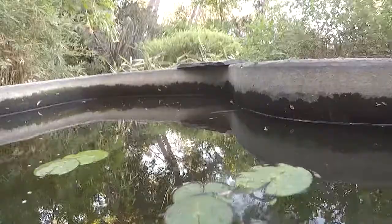We're also going to be installing a new proper bottom suction and a skimmer inside the pond here. As you can see, the water is very murky, very dirty. They actually installed a sand filter and a pool pump on this old system, so it wasn't circulating very well. It was high energy, made a lot of noise, and the sand filter is not very easy to clean and maintain. So all that's going in the trash.